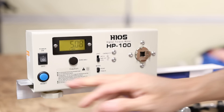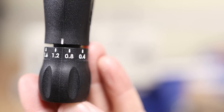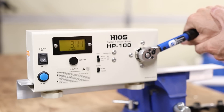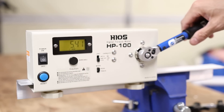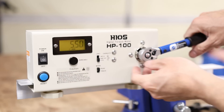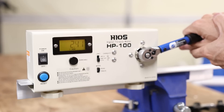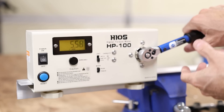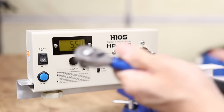I'm going to set the Park Tool to 5 Newton meters — 5 Newton meters between the 4 and the 6, and the knob is at the 1. And the reading is 5.41. Well, that's almost 10% off. Let's try that again — 5.5. One more for good measure — 5.58. So it looks like the Park is reading like 10% high. Interesting.